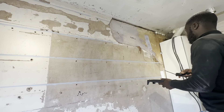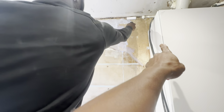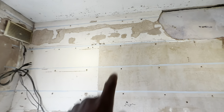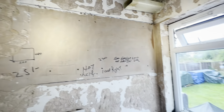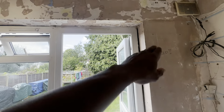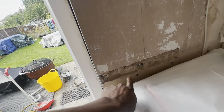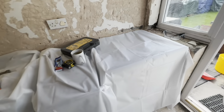Anyway, let's get into the work. Ken is putting on some SBR here and we're going to do a little bit of bonding — literally just bonding this small area and then skimming it. The only area that's actually been painted is just this little section here. Everything else is being tiled, including all around the windows and around the reveals. We don't need to skim those areas, we'll just fill them up and get it all flat and ready for tiling.